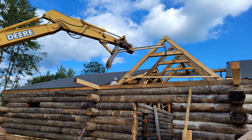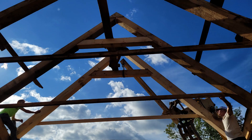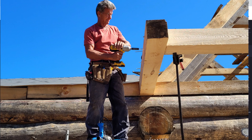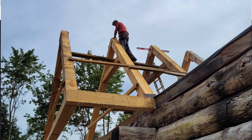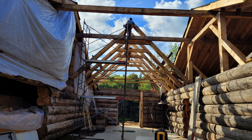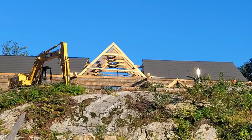On our last video, Lucy and I put up the first three cathedral trusses, and then Wayne and Tommy came up and put three more trusses plus the supporting beams for the overhang truss. Here is Dean securing the beams for the overhang truss, also securing the beams together with planks in between and leveling all that up. Here are the seven trusses up — this is the back view from the house, and here is the front view.